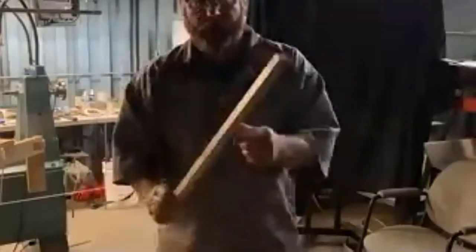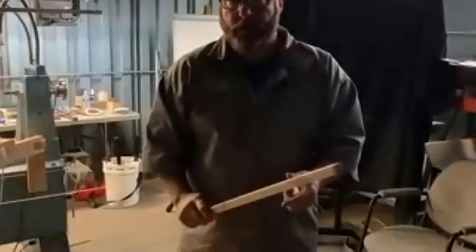Nothing in particular on my saw table at home. I'm just using a regular Diablo blade that I got from Home Depot. Basically almost identical to this, except it's red. Yeah, and I use the same. It works well. You don't need an 80 tooth blade or anything like that? No, nothing crazy. Just sharp is really the most important thing. All of the cuts you're making here on your segments are going to be cross cuts, but you also need to be able to rip your piece of wood. As a matter of fact, the blade I have at home, I believe they call it a combination blade. So it's kind of an all purpose blade, and that works for me.